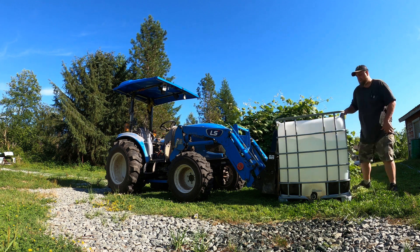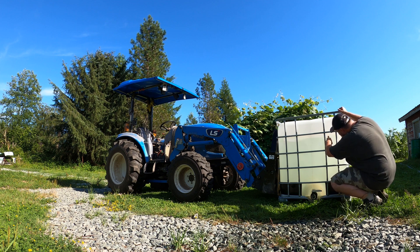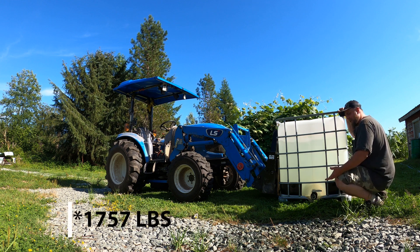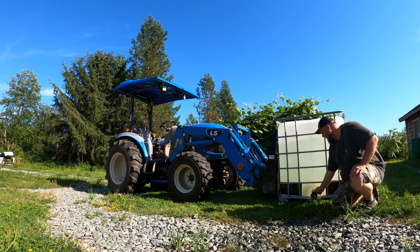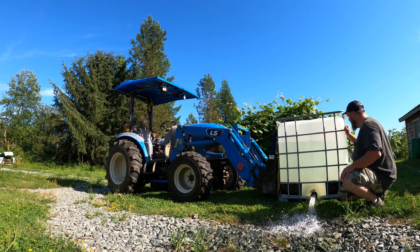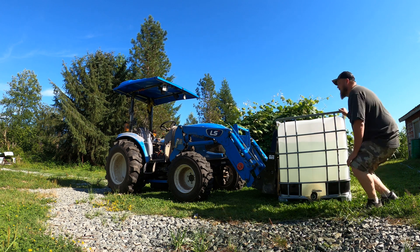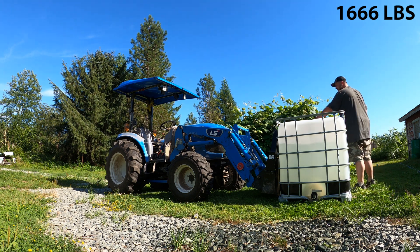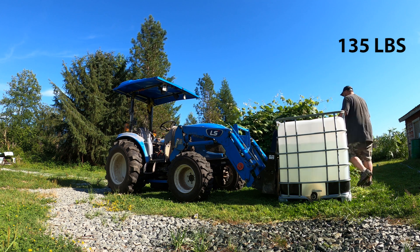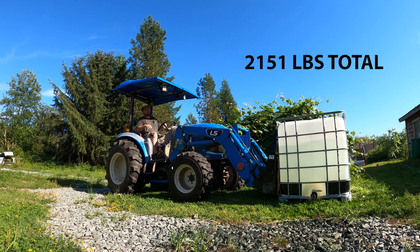Eye level is about six feet tall, so we can get it in the back of a truck. Let's add some water and get it down to 200 gallons. 200 gallons is over 1,600 pounds, plus the weight of the tote which is 114 pounds, plus the weight of the forks which is 300 pounds — so we're lifting about 2,000 pounds total with the forks.